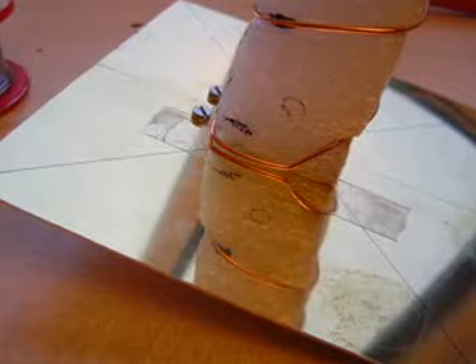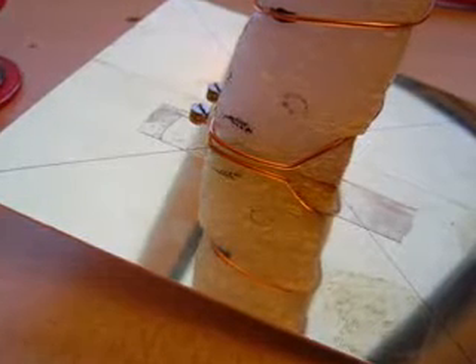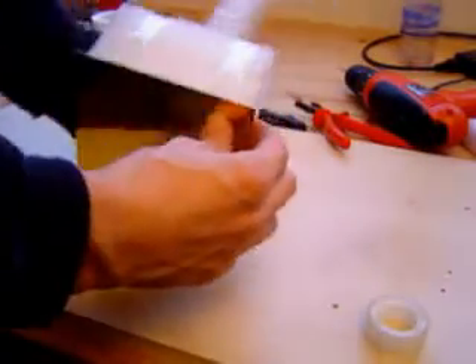Check this carefully and place some tape under the wire to prevent short circuits. If one of the bolts is in the way of the wire, remove it. Now the foam squares can be pushed down and fixed with tape.